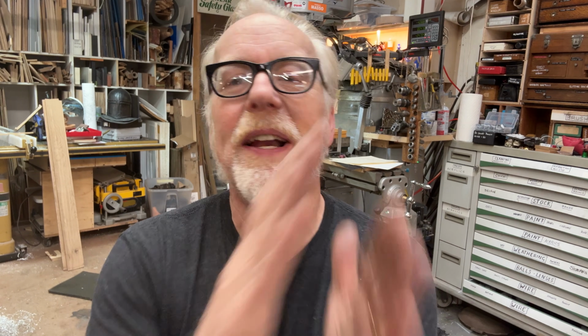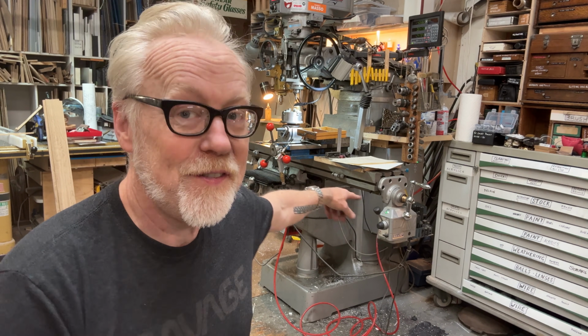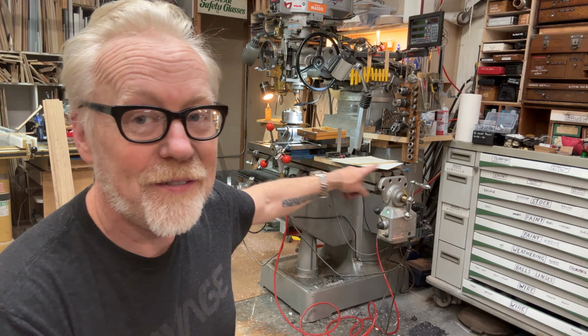The fact is, whenever you have parts sliding, you will have parts wearing. Even a machine as beefy as this, I can feel is getting tight out at the ends of the ways, because you usually use a milling table in the middle. And so you go back and forth and you wear down a micron here, a micron there. Soon it adds up to real measurement.